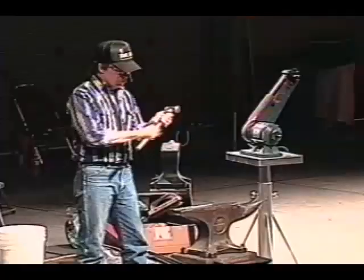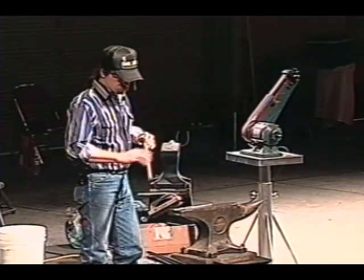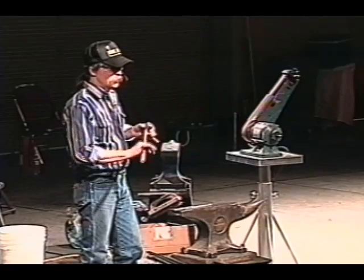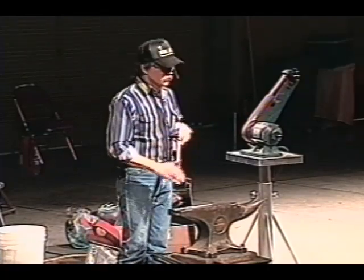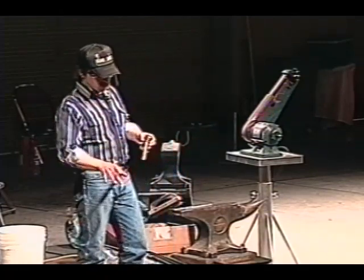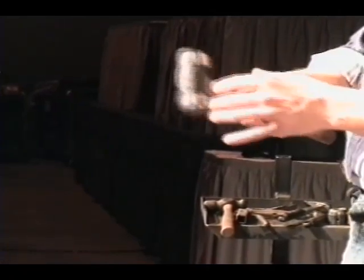One thing I've found when I've prepped out a new handle is that I sand it as smooth as I can when I'm finished shaping. Get it sanded nice and smooth, working down through different grits of sandpaper, maybe a bit of steel wool, something like that. Get it smooth. And then I give it one coat of linseed oil. That's it. That gives me a good start because now I've got something on there that when I grip it, I get a little stick.